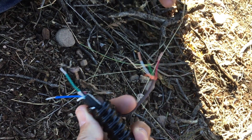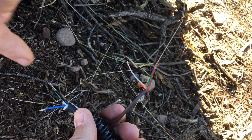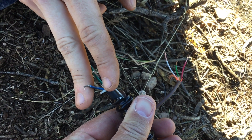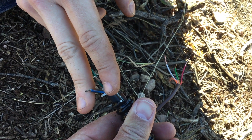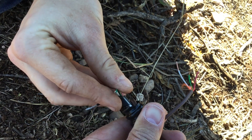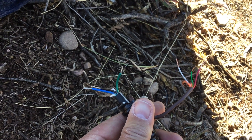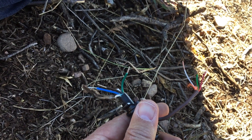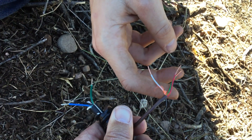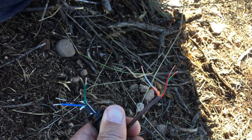The REM will read the switch when it gets wet, and in turn tell the auto-sampler to trigger and take samples. Once that is all complete, the auto-sampler will tell us it is finished via the green wire. It is going to send a signal back to the REM to notify us that the program is done. With this switch we are able to tell right when the program starts because we are the ones starting it with those two wires.